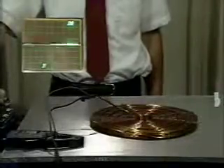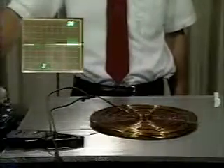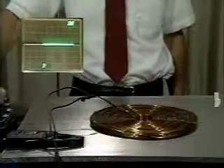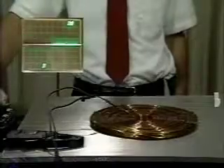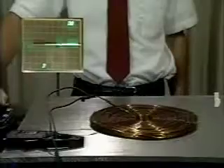The 250 turns are of number 10 aluminum wire. Aluminum is chosen for its light weight — its density is 2.7 grams per cubic centimeter — so that for a given current and thus magnetic force, the coil will rise higher than if made of copper. Although copper is a better conductor by a factor of about 1.6, its density is about 3.3 times greater than aluminum.